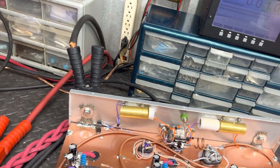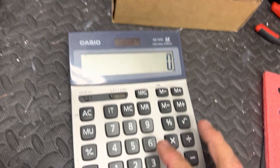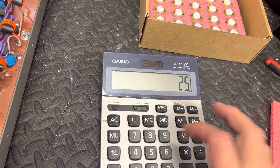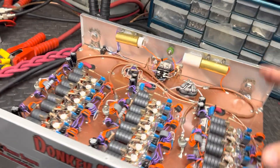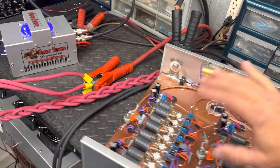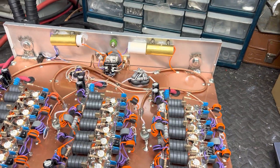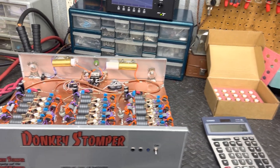The answer is never gonna change — it's gonna be the same every time: 25 watts per output transistor. If you've got a two-pill, two times 25 equals 50. We're counting the last section of pills — the output transistors. So for 24 pills it's 600 out. If you've got three more pills driving it, those don't count. You count the output transistors only.